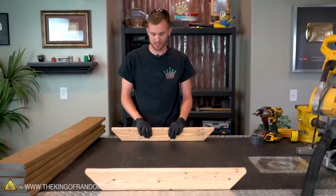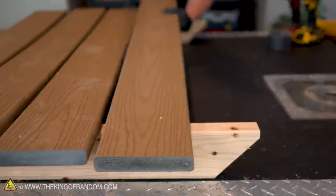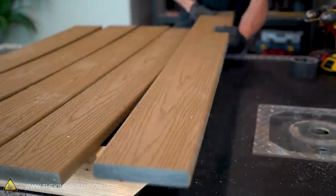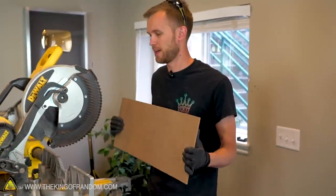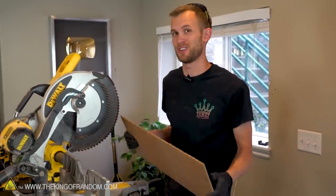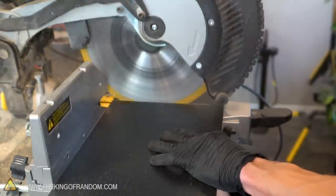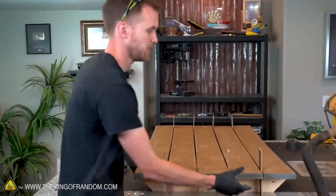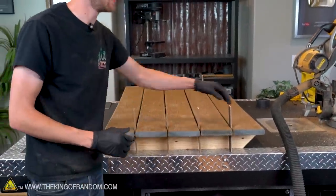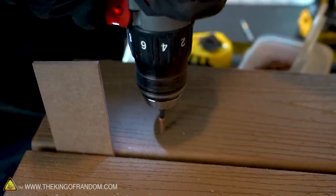We're going to be attaching the 5 composite planks to the 2x4s using screws going down from the top. We now need to line them up in just the right spot on top of these beams and spaced out the right amount. We want the support to be 4 inches in from the end of our board. Our scrap of board is going to be cut up and used as spacers to make sure the slats are evenly spread out across our table. We'll start by securing one board on one end, make sure everything is pressed together and spaced out just right, then secure the other end and then two in the middle. For the moment, we'll leave the very center board unsecured.